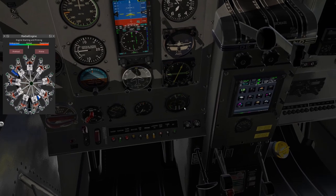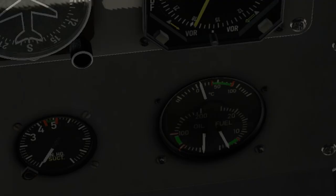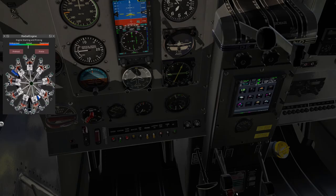We still have to manually pressurize the fuel line. Using the red lever, we raise it up and let it drop down. And we'll see that slowly but surely, the gauge registers an increase in pressure as we pressurize the lines. Normally takes 4 or 5 pumps of the lever to get the pressure between 5 and 6 psi, which is ideally where you want it to start. Beacon light is on, prop is clear, let's start her up.